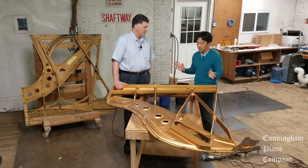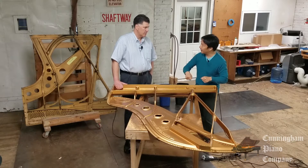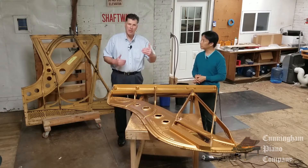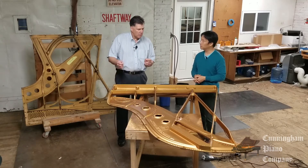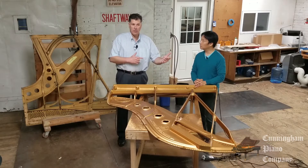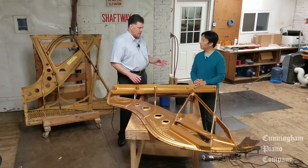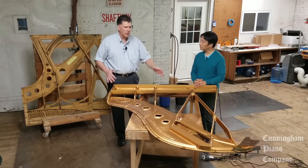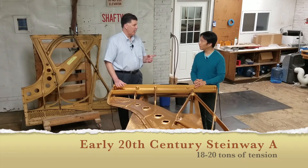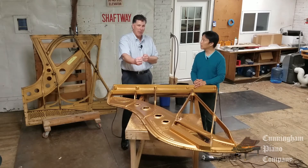Just out of curiosity, on a modern piano, how much pressure is being applied with the strings being wound around and tightened and tuned inside of a piano? Sure. So first let's talk about the definition of the modern piano — to me it's around the 1870s. If we play an 1880 instrument by some of the finer makers, let's say this is a Steinway frame, it's going to be very much like it is today in technology and in the way it's built. This cast iron frame is from an early 20th century Steinway A. This particular piano had between 18 and 20 tons of tension on it. We're talking about high tensile steel treble strings stretched to a particular mass and a particular tension.